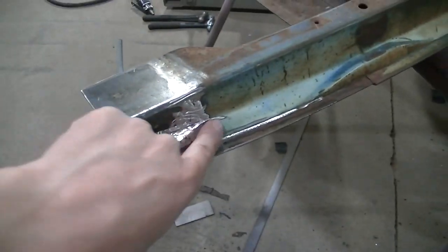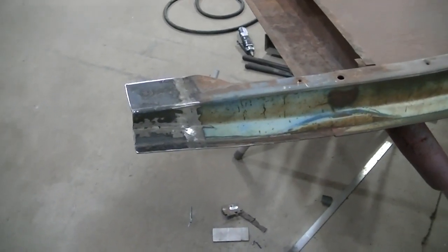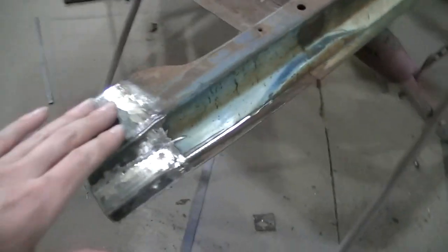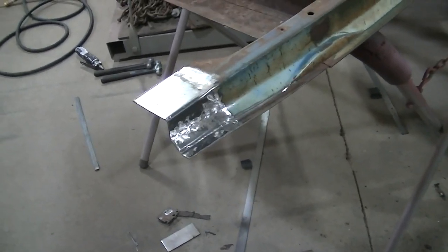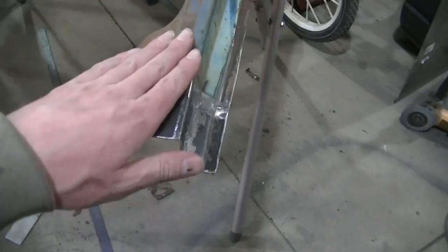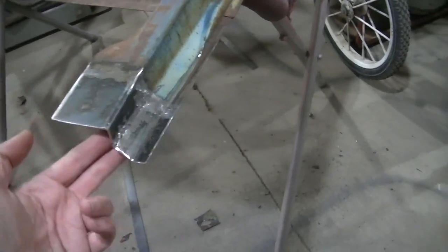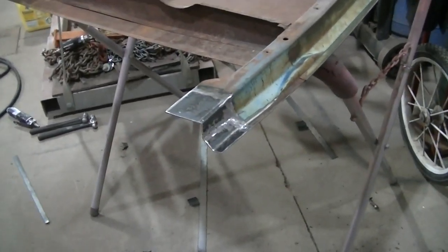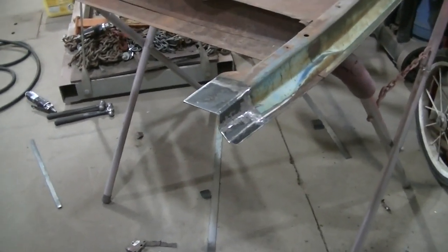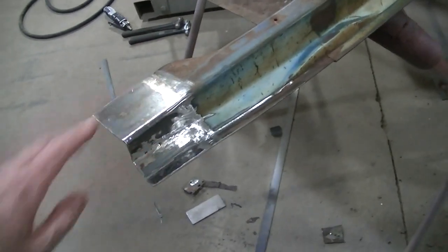The contours look really good here. Obviously, if you want to paint this all up nice, you're going to have to do body work, because there's no way around doing a little bit of body work when you're doing rust repair. But real happy. I'm not sure if I'm going to weld the underside or not. I feel like I got really good penetration. This metal is actually welding really good. I don't know if it's because it's so dang thick that it's welding good. I might have trouble with the door skin, but this stuff here is actually doing really good. So really happy